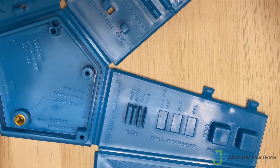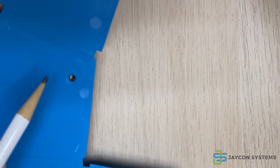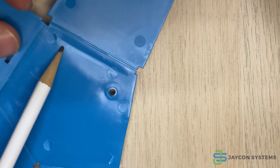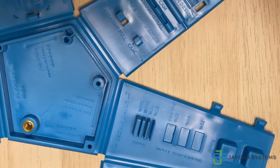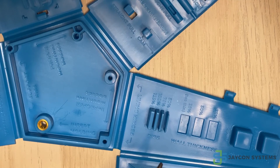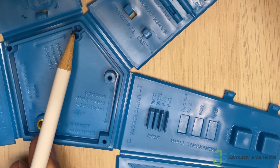On the other side there is a shrink mark occurring, but we don't actually care because this is the inside of our pencil holder — so that's not a big issue for this product. But you have to consider that when designing other products. Here you can see the mounting boss has support ribs, also known as gussets, to give additional strength to the mounting boss.